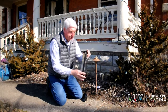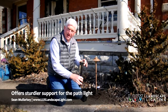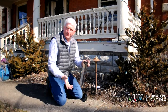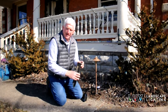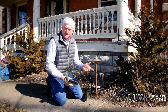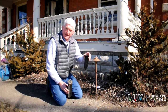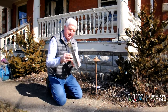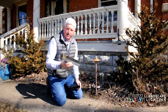Having that additional depth in the ground gives it more support, makes it sturdier, and also helps reduce some of the freeze-thaw issues we have in the Midwest. If you're in a warm climate where you don't have freeze-thaw, it's not a big issue. But with stakes, when you get freeze-thaw, they tend to work up out of the ground and make them crooked. This is affected less because it goes deeper into the soil and usually is below the frost line in our area.